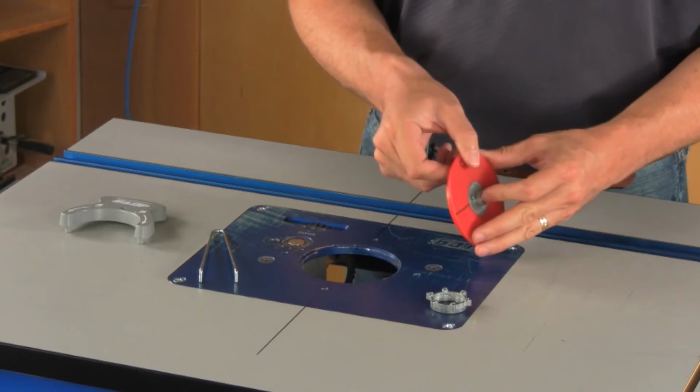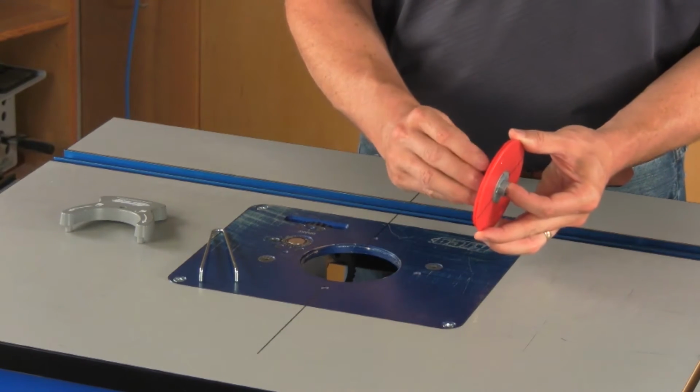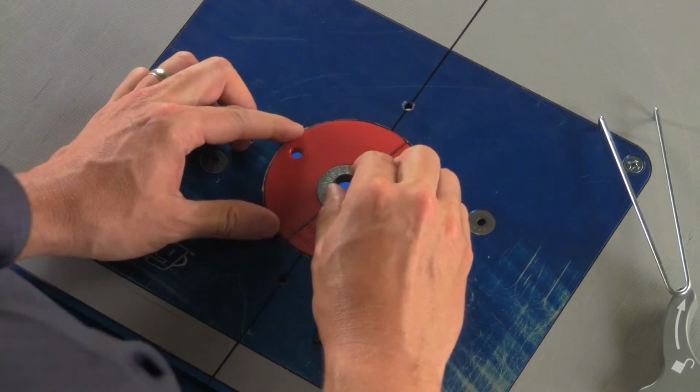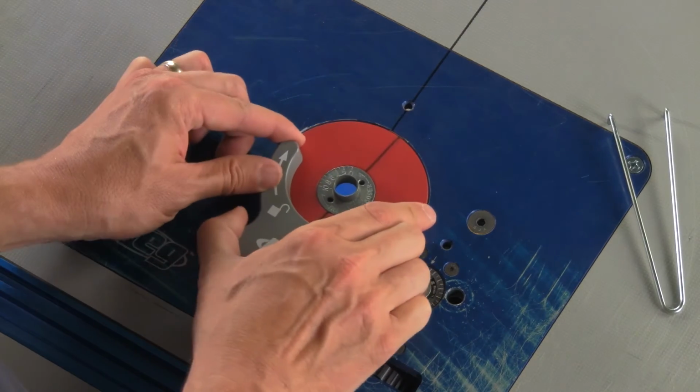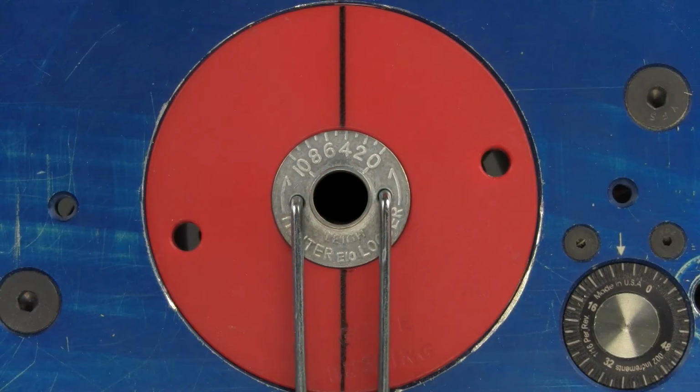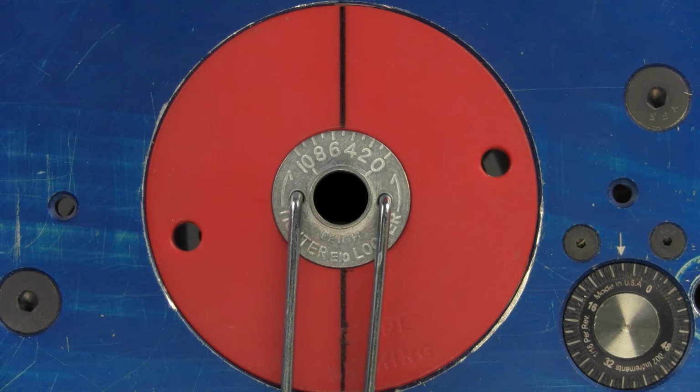Tails are routed first. Fit the E10 guide bushing to the router table or router table insert and install it in the router table. And be sure the insert is orientated the same way every time an E-bush or bit change is made. All routing starts with the E-bush set in the number 5 position.